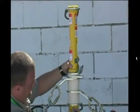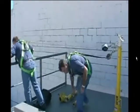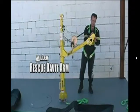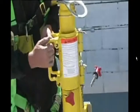The portable fall arrest anchor post features an optional 14-inch height extension to increase one anchor point to 68.5 inches in height. This option is ideal for workers who are in a higher risk area to further reduce the fall distance in case of an accident, but the total number of workers connected to the post would still only be 3.